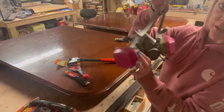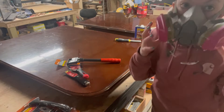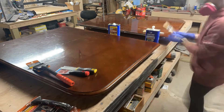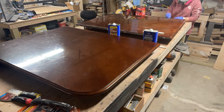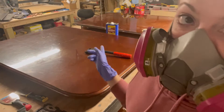I have two separate brushes, one for each. And very important — proper PPE, because I am going to be using harsh chemicals. I forgot to mention you should definitely be wearing gloves when using stripper — it is a very harsh chemical and it does irritate the skin. You should also wear safety glasses or goggles because if this splashes into your eye as you're spreading it onto the surface, it can cause a lot of issues with your vision. So you want full PPE when using stripper.